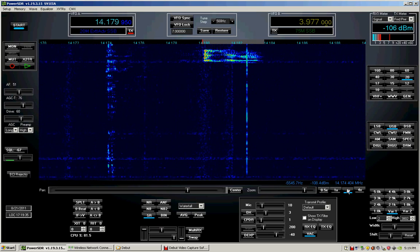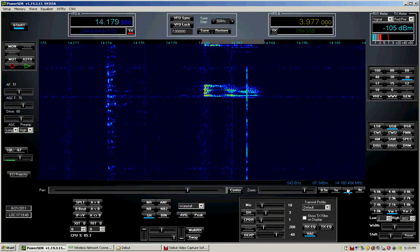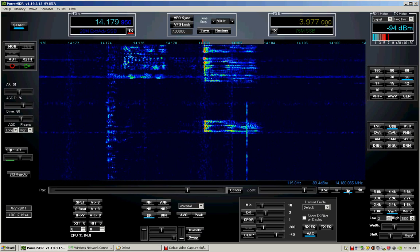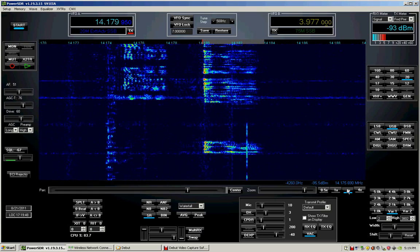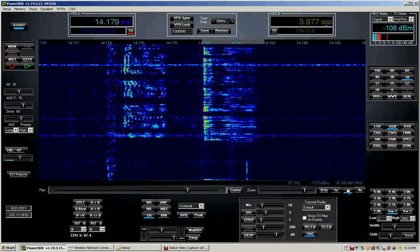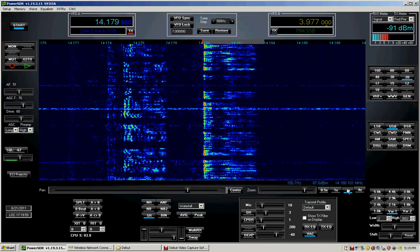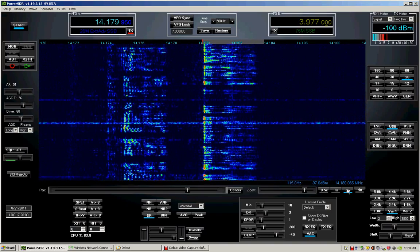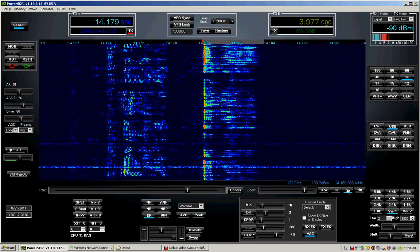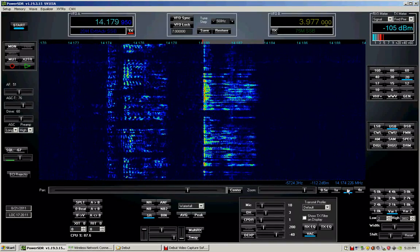Did you say you're in Tucson? I thought you might be back in New York or somewhere on the East Coast. Skip's been really funny today — worked a guy with a very nice signal up in San Francisco, which is more of a 40-meter contact. Very nice to work into Arizona. If somebody wanted to work all states on 20 meters, this would be the day to reach out to those neighboring states you can never get on 20 meters. This would be the time to do it, over.